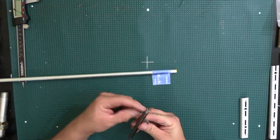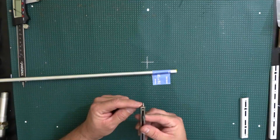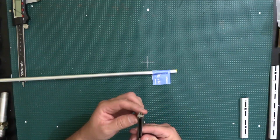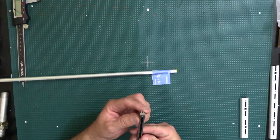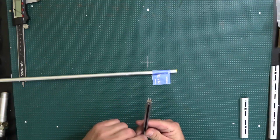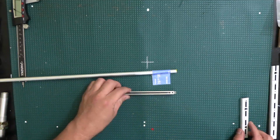And obviously these right here, they have 3 pins. They have one over here on this side, which is probably going to be my negative, and then I have 2 over here, one of which is the voltage coming in, and the other will be the voltage that gets reduced or increased depending on where you have the slider. So that's going to come into play.